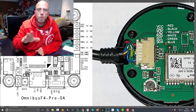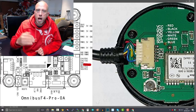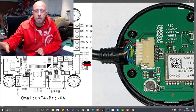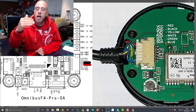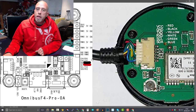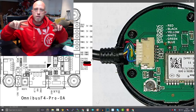Let's do the obvious ones first. Out of your GPS unit you'll have a red wire, and we need to connect that to the five volts pin, which is the third wire up from the bottom. We also need to connect up ground — the black wire coming out of the GPS unit goes to the fourth pin up from the bottom, or the third wire down from the top.